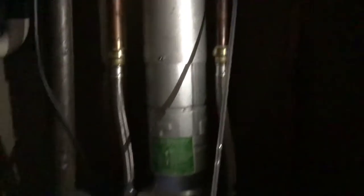I am in my furnace room. This is my hot water tank. You can see I have these right here coming up and tying into the copper. The inside of these have a rubber lining, and that's what's breaking down and coming through your hot water taps and causing those little flecks.